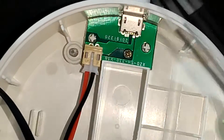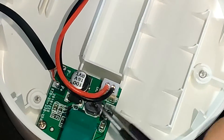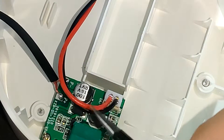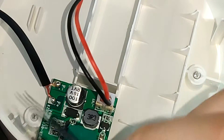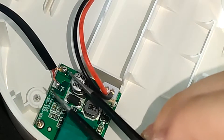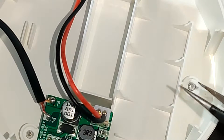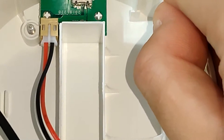Taking a closer look at this mini board — this looks like just a daughter board. It doesn't have any chips going into the power line that goes into this main board right here. This main board looks like a control board with a boost converter that turns 5 volts into something higher, and it controls how much voltage goes into the fan. It's a pretty easy design to mess around with.